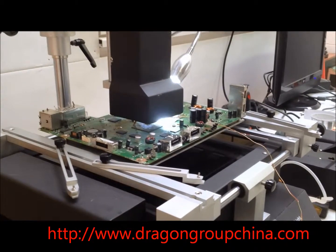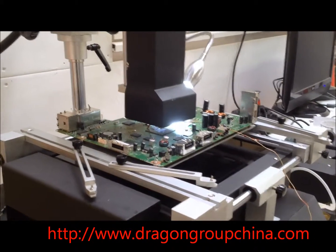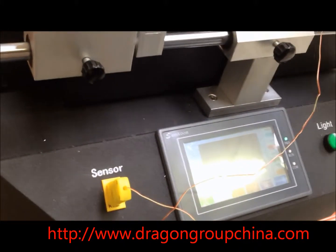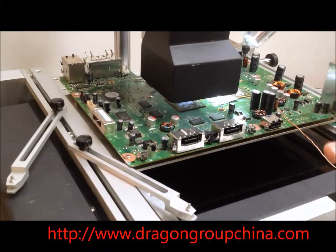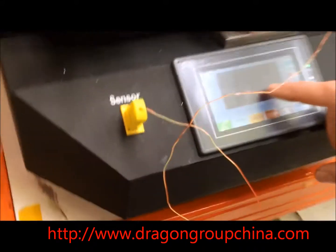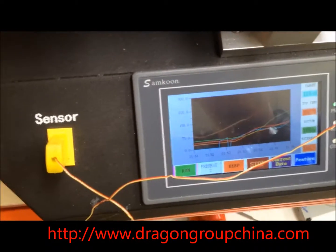What's the guesstimate on how long this is going to take? It shouldn't take too long because the bottom heat has got going quite fast. There's 4,000 watts of Elstein heat on the bottom, which can really get going quickly. Which gets the glass hot and then it just stays at a steady temperature. You can see that with the green line as it goes up, and then it'll just sort of flatten out, which is towards the end of the profile.